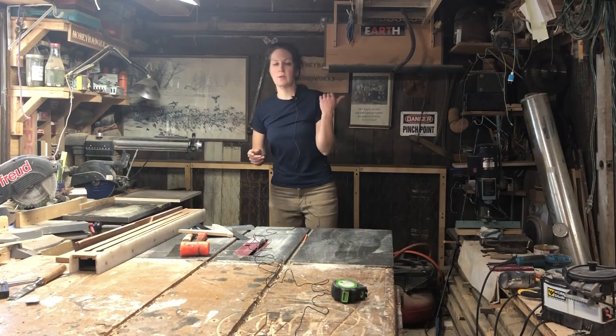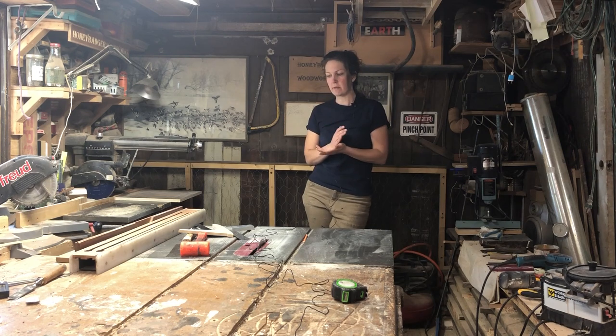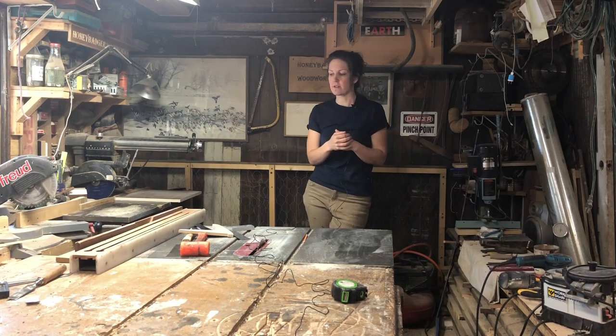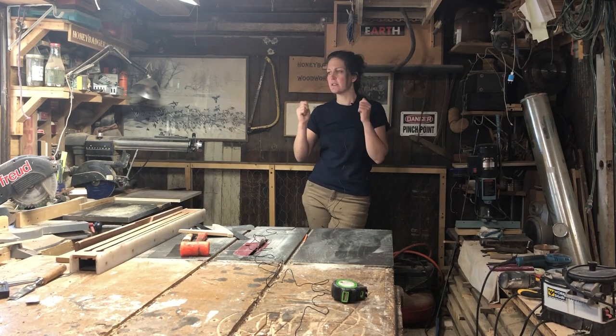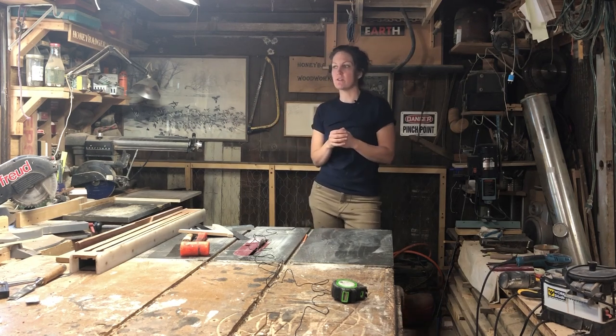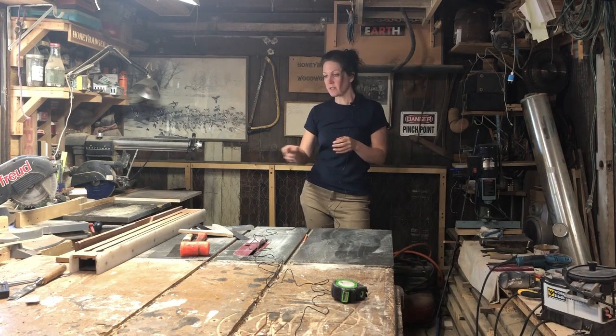The conclusion to the back room renovation is going to be refinishing the floor. The floor wasn't even a blip on the radar when I started the job, but after taking down the ceiling as well as the plaster on the wall, I had to lift up the return in the corner. I noticed that you could see there used to be exposed tongue and groove flooring that was still rather thick, so sanding it down wouldn't have been an issue.